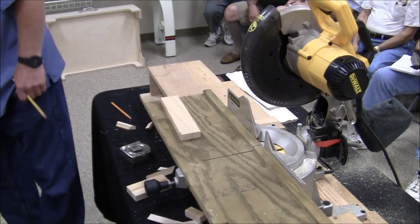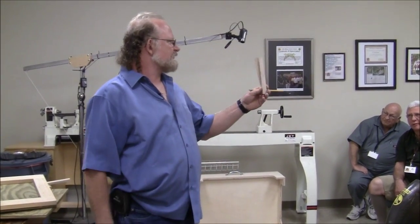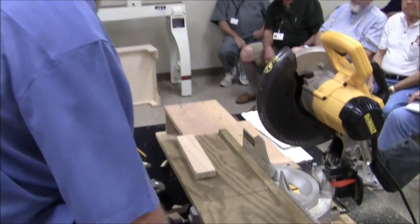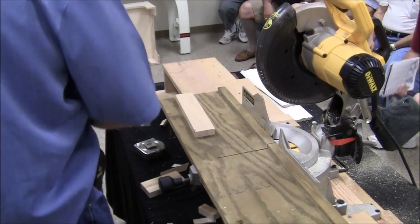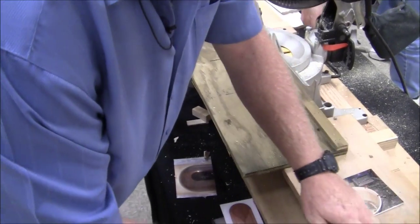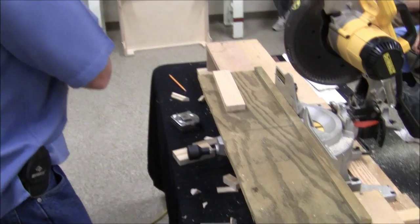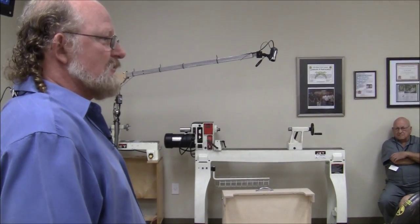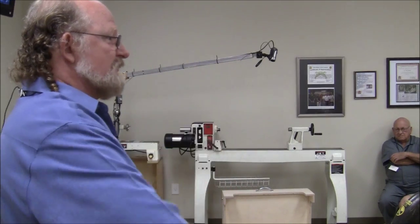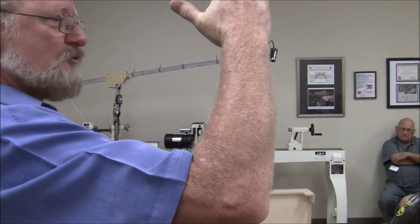I always have some shims handy — they come in useful for many things. Now let's get to working with some crown molding. Did you make the shims up on site? No, I made them up in the shop. I have a little jig I use on the table saw. I cut a handful of shims up — any time I take a block of about seven inches, the jig's got a little triangular shape basically the same as a shim, and it has another piece that sets on top so you don't have to worry about that piece coming flying back at you from the blade.